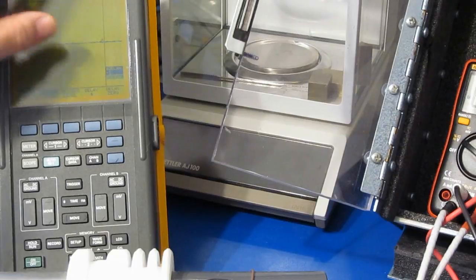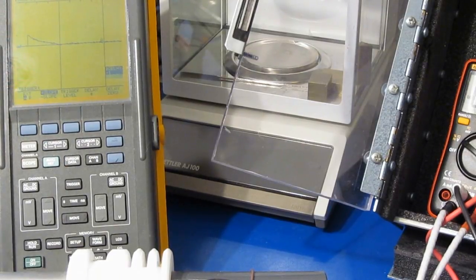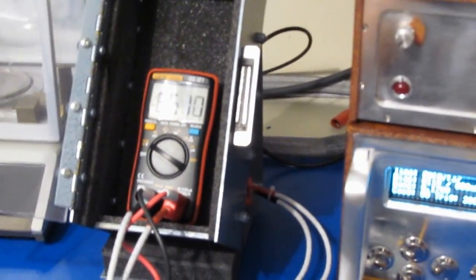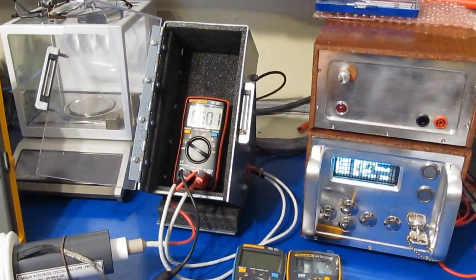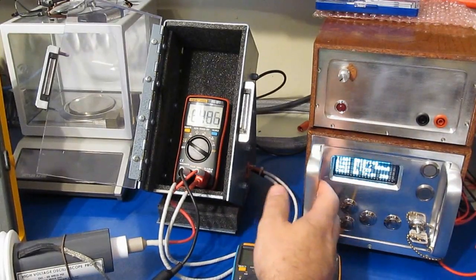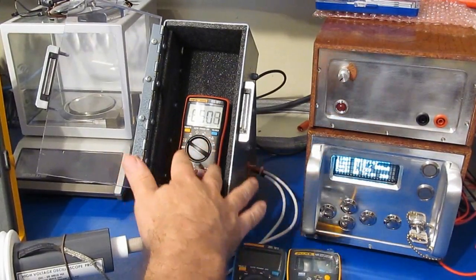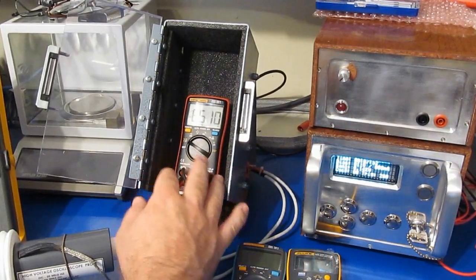So this waveform is actually with the meter disconnected, and that decay is actually created from the output network inside the transient generator. So what ends up happening normally when I'm running these tests is the meter is not actually what dissipates the energy. It's actually dissipated inside the generator, and that's all done through that coupling network. So unless the meter actually goes to a low impedance state, really no energy is dissipated inside this.